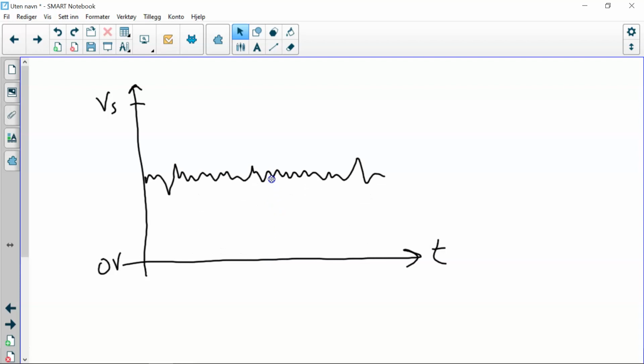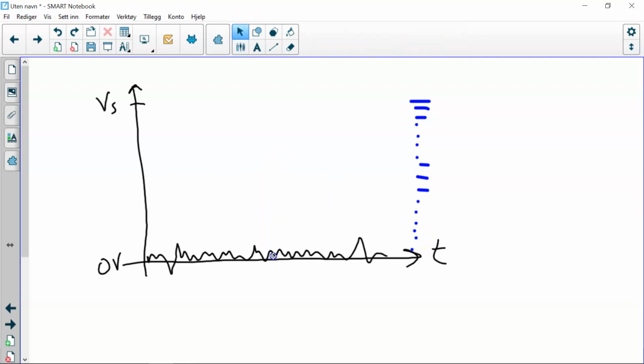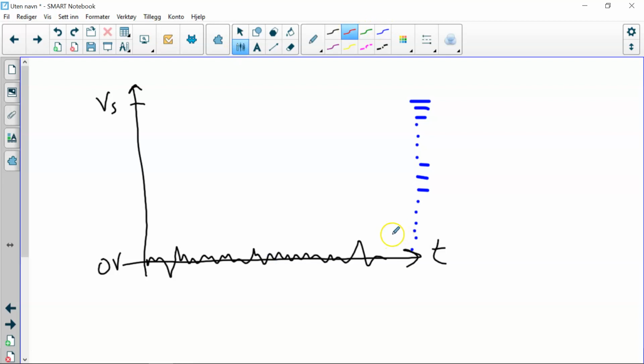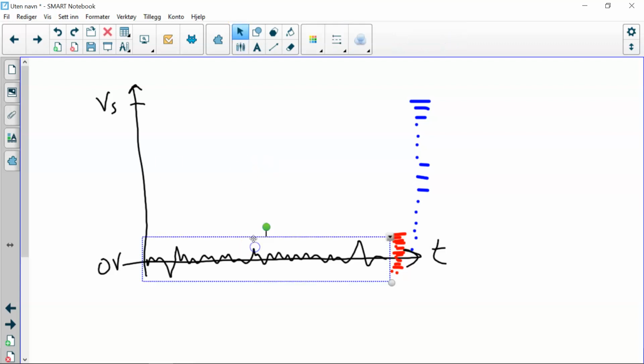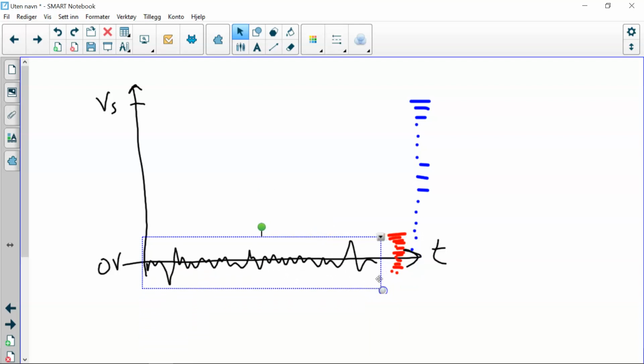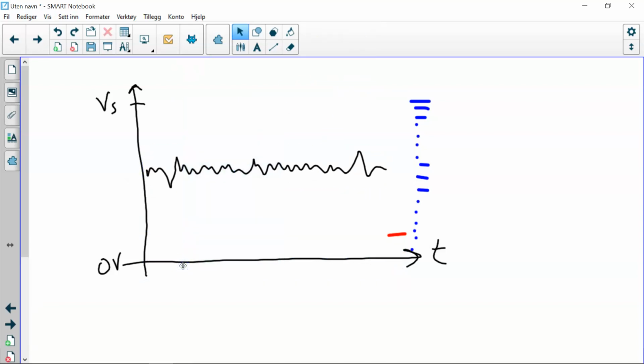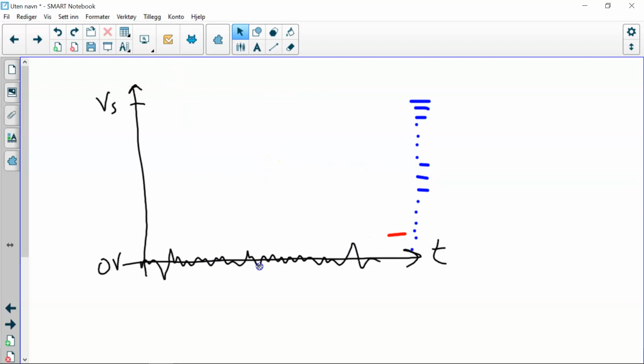That's because when we, for example, digitalize this signal here, we have to divide the available voltage into equal steps. But if we shift this one down here, we can do it with a much better resolution. We can simply digitalize from there to there. Also, if I amplify this signal like this, for example, it's easier than if I amplify when it's located where it was. So if I amplify it when it's up here, I have to amplify the entire range from here to here. So therefore, I would really like some tools to shift this one down to the lower part here.